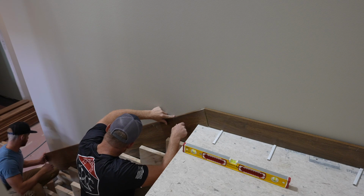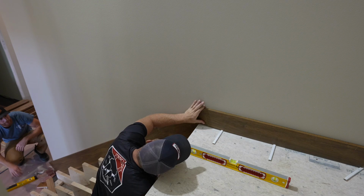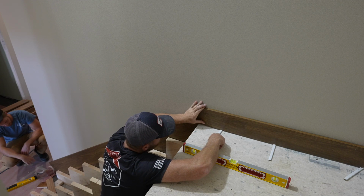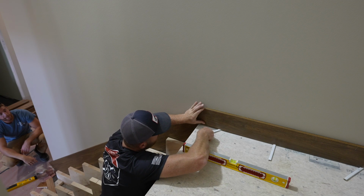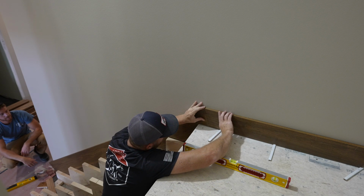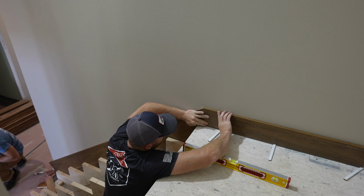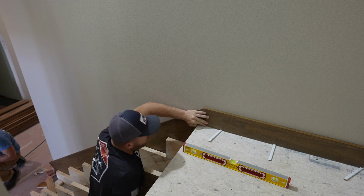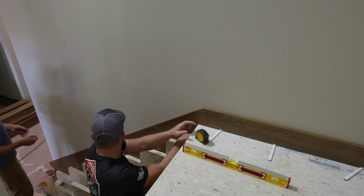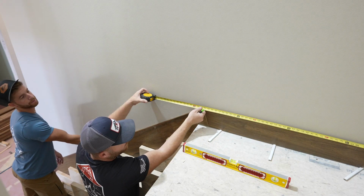Angle looks, you gotta go way down yet. My angle and everything looks good. I'm just a little high, which could be the crown in that or debris or whatever. So I'm thinking that if we screw and glue this right here, that's gonna be money. All right, hold this where it is. So now let's go ahead and get this measurement here.